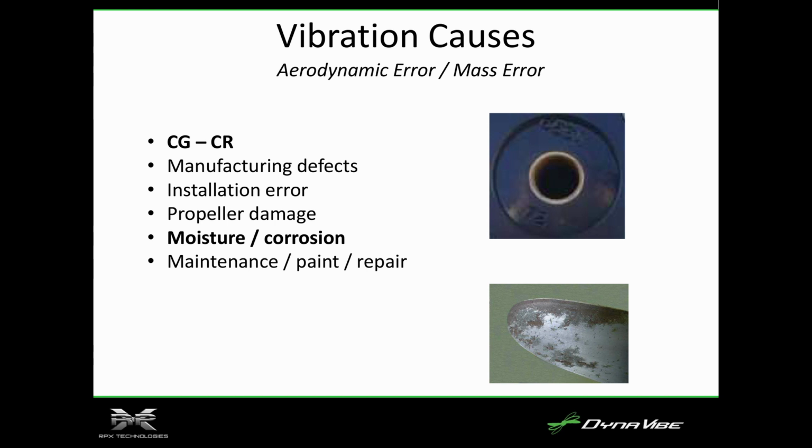So by extension then, do they go out of torque when you get back in the humidity, loosen it up? No, because you always take the prop bolts off, right? So I wouldn't have even noticed if it had. So every 25 hours on a wood prop, I take off the safety wire, loosen all the bolts, and then retorque them back to spec, and then re-safety wire. And it's a real pain, and it's just part of the process, because I've been burned by...